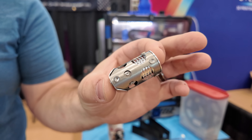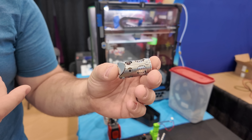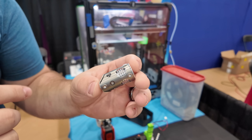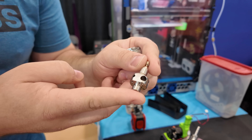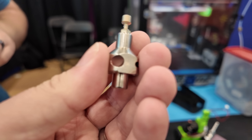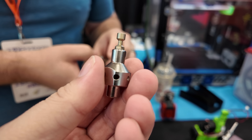This is 47.2 millimeters long, and it supports a 6x16 or 6x20 heater. We're shipping it with a 6x16 out of the gate and just a standard thermistor, standard V6 nozzle. It might be small, and you might see some heat sink fins here — look at all this melt zone. This has 33 millimeters of melt zone, the same melt zone as a Slice Magnum Plus in the length of the original Mosquito.